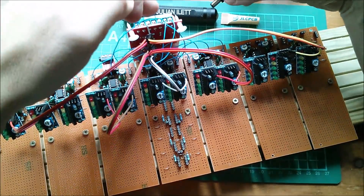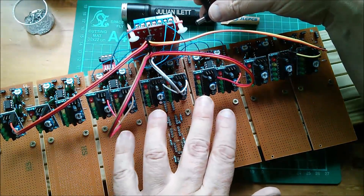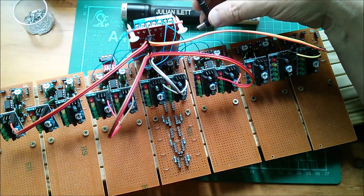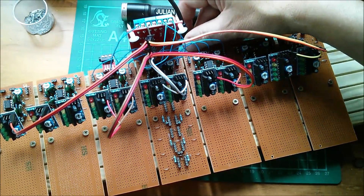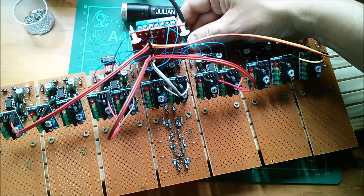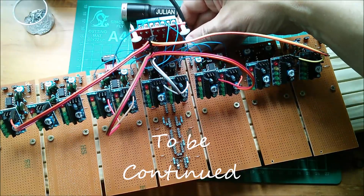Right, I've checked all the plus 12 volts and minus 12 volts, they all look correct. I'm going to do an initial power up. All that will do is put five volts on these VU meters. I've also got it going to the outer ones but they don't have ground yet so they won't light up. So let's just try plugging that in — and yeah, those light up and pulse fully up to the top. So that kind of looks encouraging. I should also have plus and minus 12 volts on my analog boards now. Now I need to feed it with some sort of audio signal.